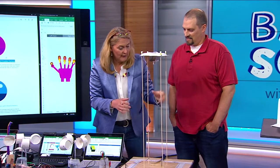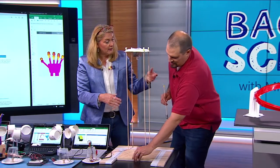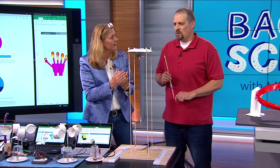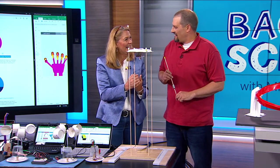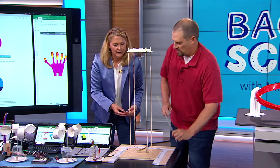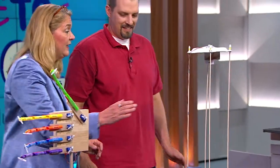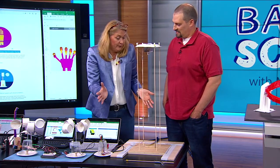This model is made out of a paper plate, straws, dowels, and a rubber band. We will simulate what would happen with an earthquake and then add the tuned mass damper. For those who have been to Taipei 101, that's a 660-ton ball that lives between the 80th and 90th floors and counteracts the activity of the earthquake. We're going to model some catastrophic events related to seismic activity or heavy winds and see what happens with the shaking of the building. Students observe the actual oscillations of the building, but also get a visual representation on Excel. Let's run a trial without the tuned mass damper first — and you can see not only is the building shaking, but the graph is being driven showing what happened in the violent shaking.